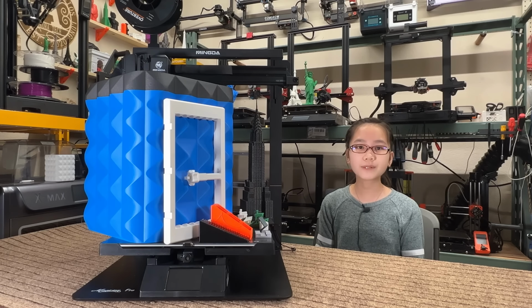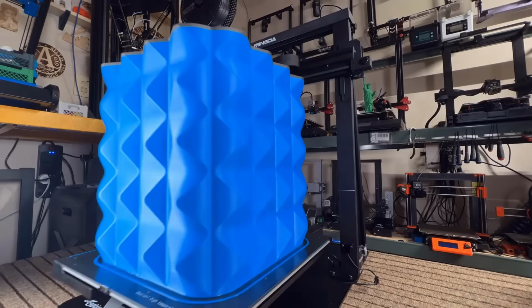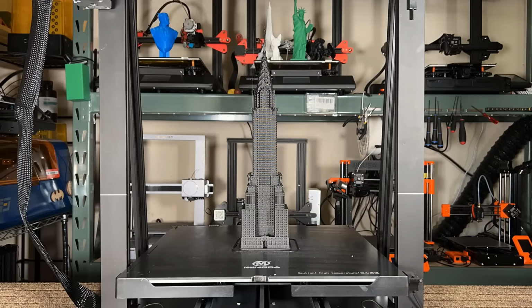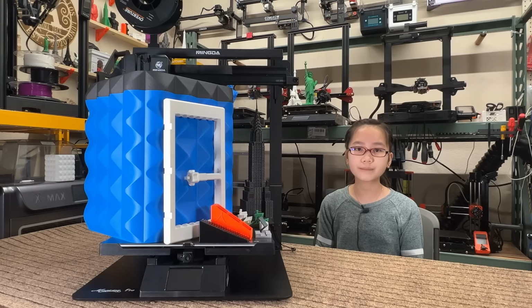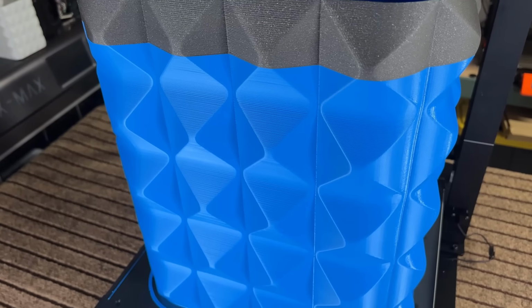In conclusion, this printer is a very solid, large printer. You pay a similar price for a mid-range 300x300x400 printer, and you get all the same features, plus the 78% larger print volume. It prints very well after the print bed is secured by 2 extra binder clips, even for models that almost use up the maximum Z height. Normally, for a 400mm tall gantry printer, you would expect the top of the print to not look as good as the bottom, but for this printer, I cannot see a significant quality difference between the bottom and the top of the print.